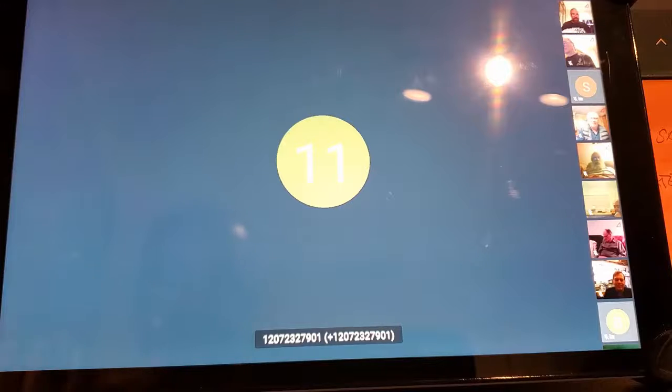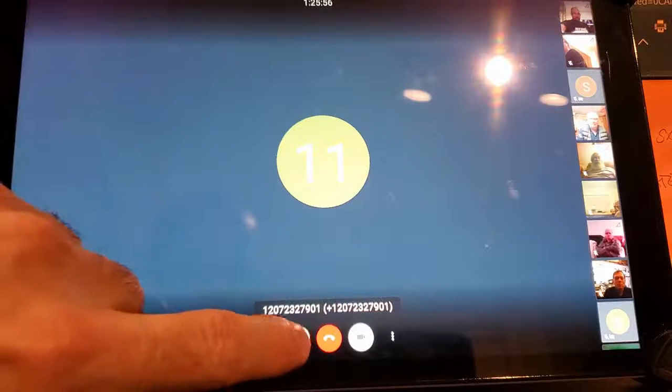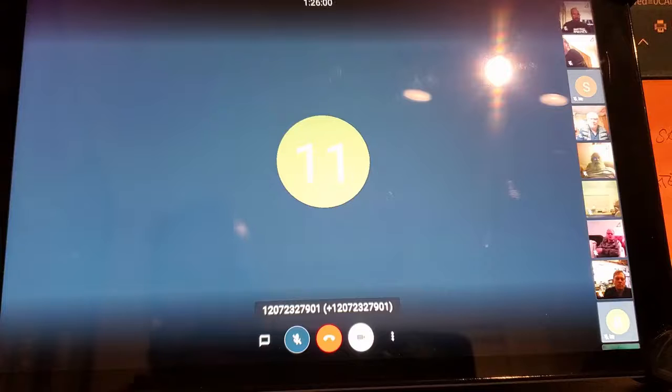So I went searching today to find some Millen RF chokes, and I found them, and in the process of finding them, I found my AADE meter, so now I could actually measure some of this stuff. I found a set of chokes that were close to what I was looking for and put them in, and I got the prototype up and running tonight. I've got chokes that I bought from a company down in Florida that look like they'll do the job. So I don't have to have the crazy RF chokes that we see from the old days, the three or four stacked pie sections on a stick. Don't need those anymore, I don't think. So I'm good. Do we have any experts on RF chokes on the call at the moment that might be able to lend some assistance if I run into any issues?